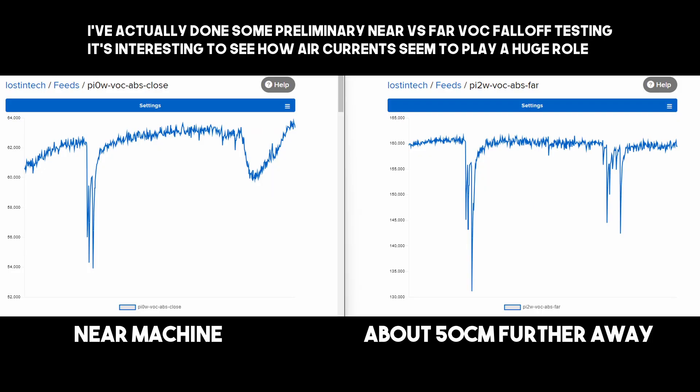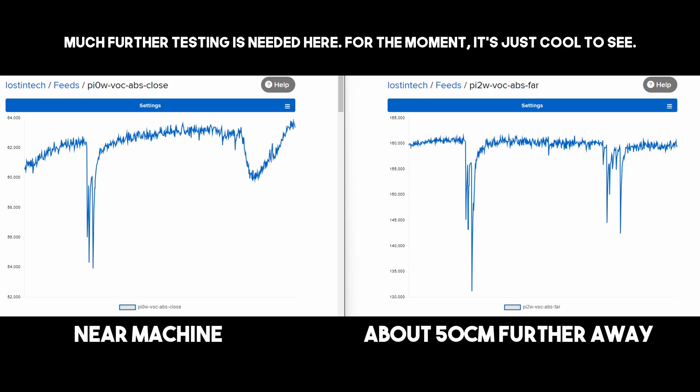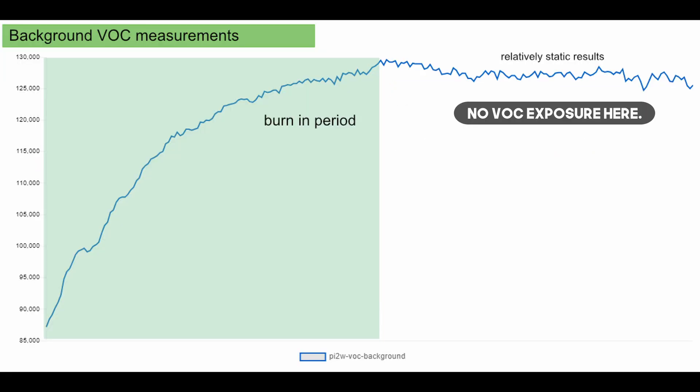Remember that this is a small 12-minute test piece, and I haven't yet tested how much those levels build up over time — I'll need an isolated environment to do that. I really want to emphasise that this is why every study that looks into this problem always seems to point to the importance above all else of air changes in the printing environment. And changing the air might be easier than you think. But before we go into that — what if you could just not? What if you could print ABS, nylon, HDPE and not have to worry about the more horrible smells and chemicals?